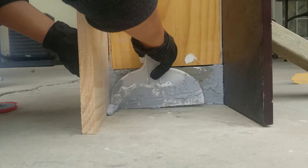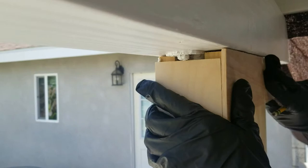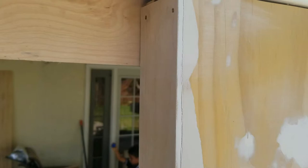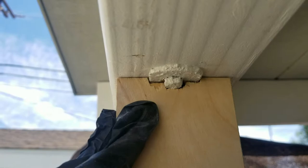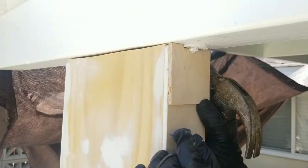Here I'm measuring the top board — this crown molding — which is going to give the column a nice finish. I measured one side, marked the thickness of the board, and that's where I want to cut. I made this cut with the jigsaw. It doesn't have to be perfect as long as it's flush to the wood, because we're going to be adding caulking to seal those openings. Then just go ahead and nail it in.